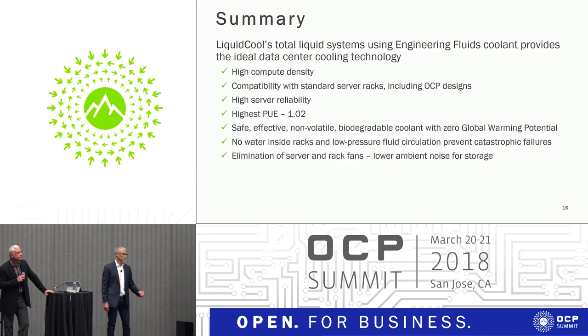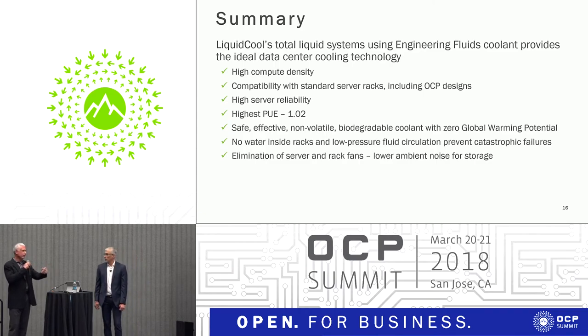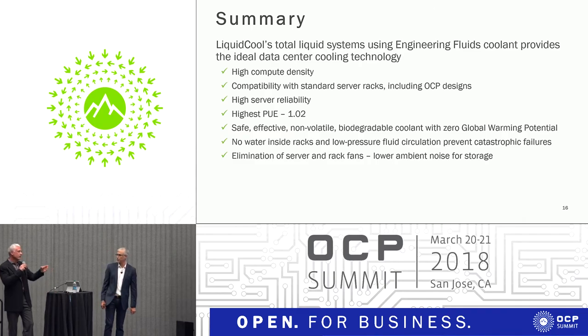Yes, we are relying on an external CDU for dielectric fluid movement and heat rejection from the primary to the secondary side. The most cost-effective way is an external series of pumps — very efficient, very high MTBF. We always advocate using dry coolers so there's no water use. Because of the temperature, you can basically do a 60 to 50 degrees C delta-T over 10°C and be very effective. We've had both CDU installations and in-rack CDUs in some demonstrator cases. We're doing an install right now in a data center in Twin Cities hooking into the water loop.